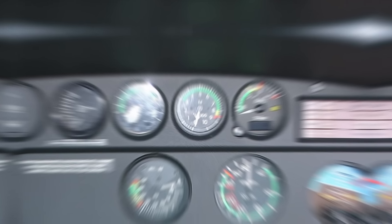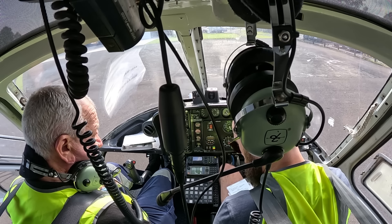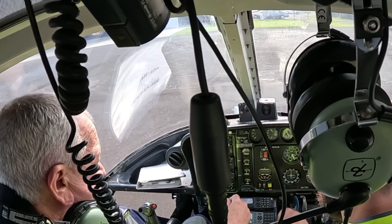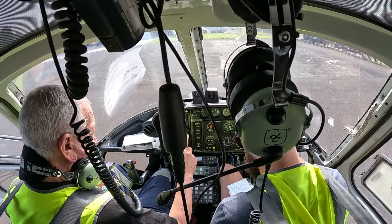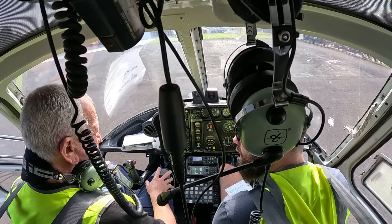So the numbers we're looking for: at 10% we introduce fuel. Fire's off, it's a modulator to start, so finger stays on the button all the time. At 25% the blade should be turning. 42% — finger off. Accelerate through to 70%. Then we're going to put the generator in after we've been there for two minutes. So two-minute warm up? Yeah, pretty much — as a first start, yes.